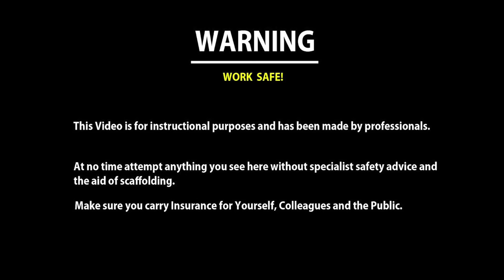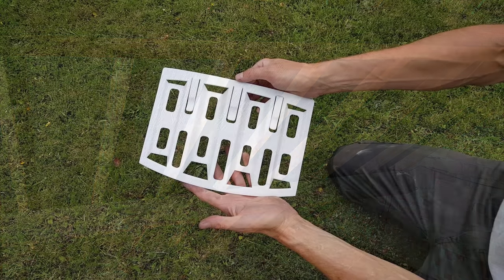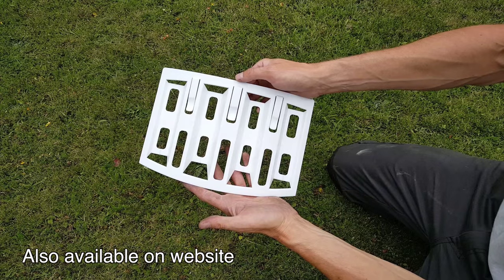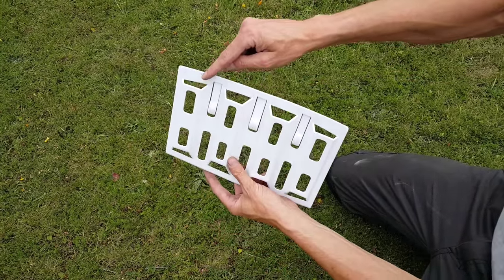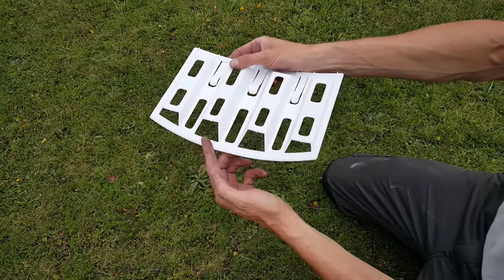In this video I'm going to be looking at probably the simplest and cheapest way to add roof ventilation to a loft or roof space that has breather membrane or bitumen type felt. This is a lap vent, and this particular style is one of my favorites because they're lightweight and won't damage your felt or membrane as long as you're careful. If you turn it over you can see the vents that sit directly between any overlaps and underlaps in the under sarking in your loft.